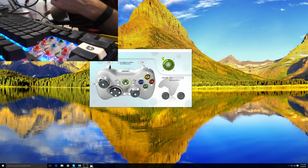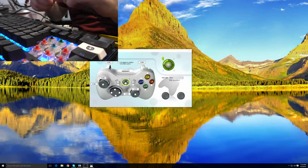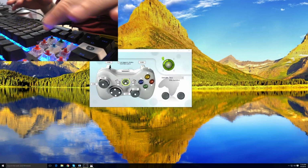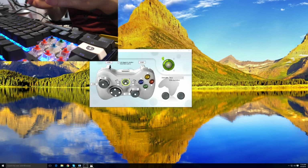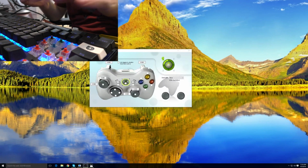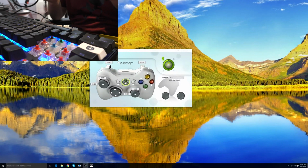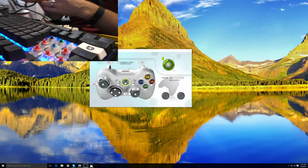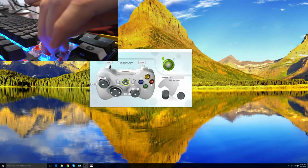Since those properties are so different between each of the different manufacturers, even if I take one switch that's exactly the same as another one, like a Cherry red switch, and pull it out and put in another one, it's going to exhibit different properties. Simply because there's too much variance and we're sensing things at such a high level that there's going to be a noticeable difference between each key. So in order to work around that, there's a calibration routine that's built into the keyboard.